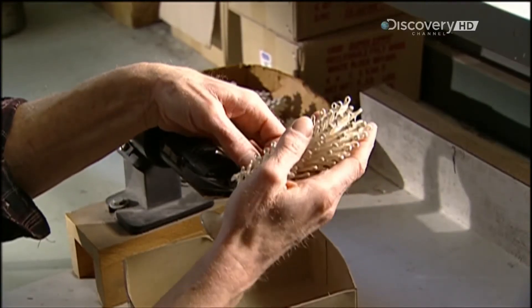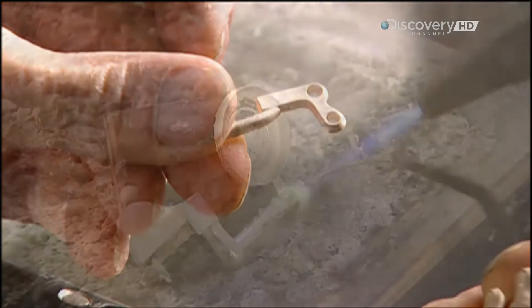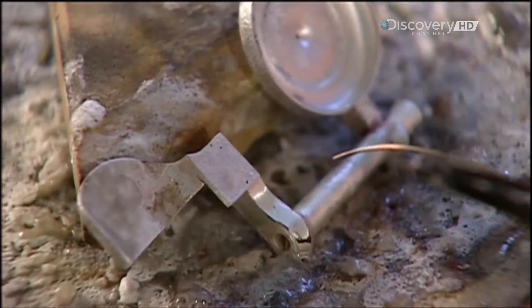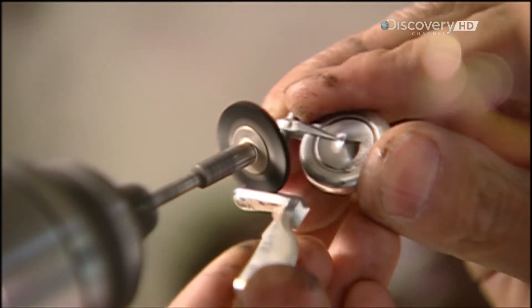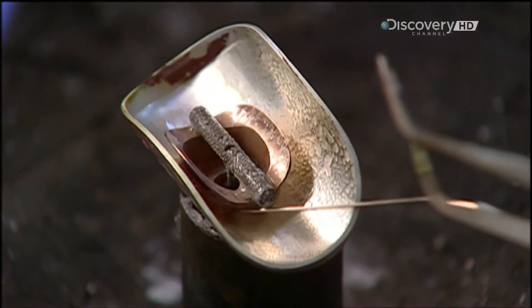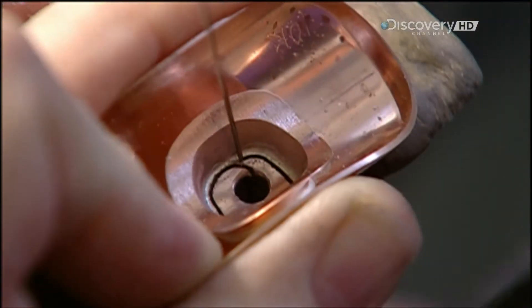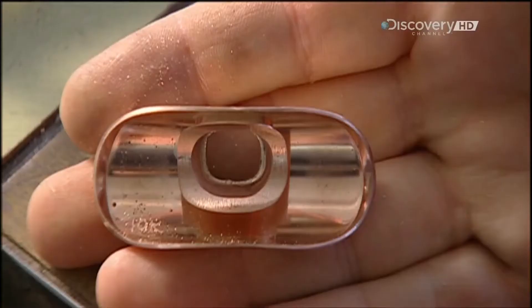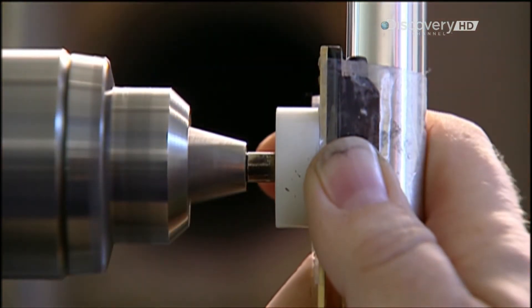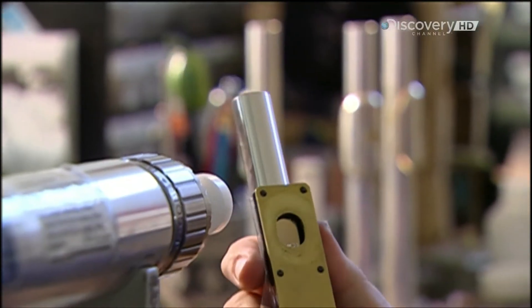The key parts have a dull finish because the silver isn't yet polished. Now they solder the key parts together and polish each finished key with a soft rotating brush. They also solder on a riser, which attaches the mouthpiece's lip plate to the head joint tube. They cut away excess metal from the opening of the lip plate, then use a lathe to cut out a hole in the head joint tube. A template ensures they position the hole correctly.